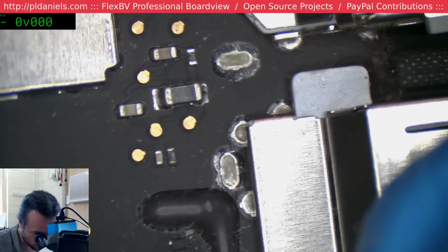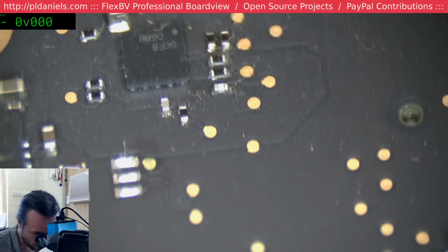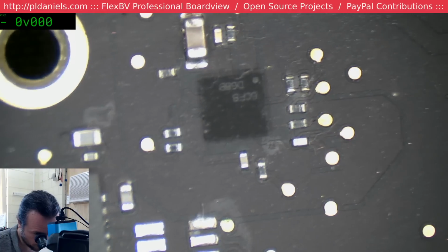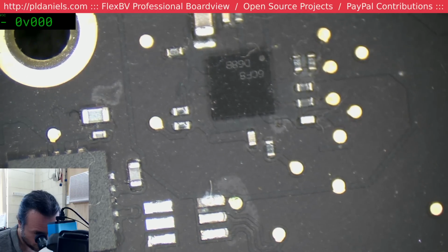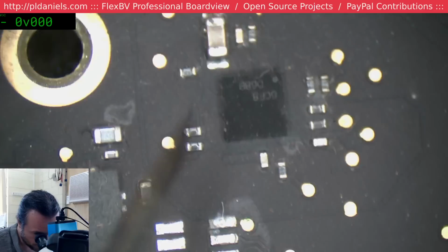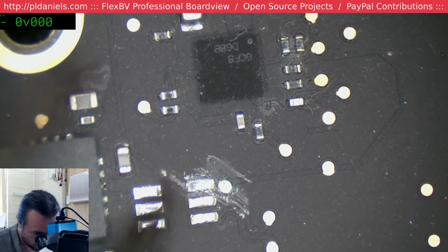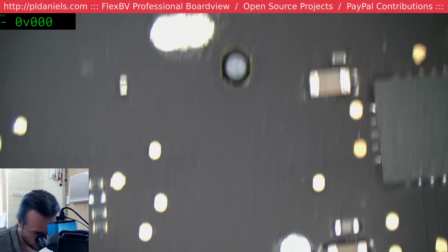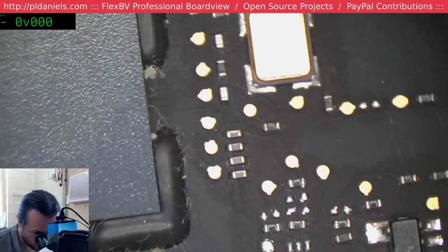Solder and flux, if you get a nice Kester 6337 grade, about, yeah, there's some corrosion there too. The Amtech flux that Lewis sells is pretty good. You can sometimes get better depending on specific circumstances, but realistically, if you're just starting out, then just pick up a tube of the Amtech flux.